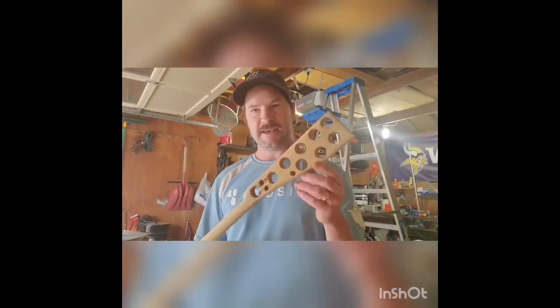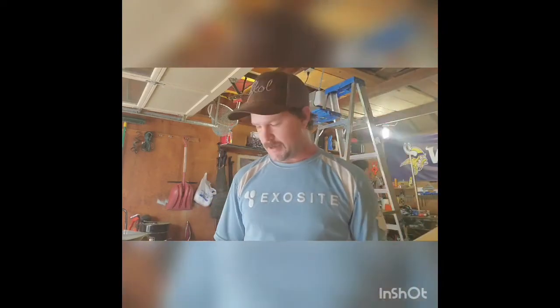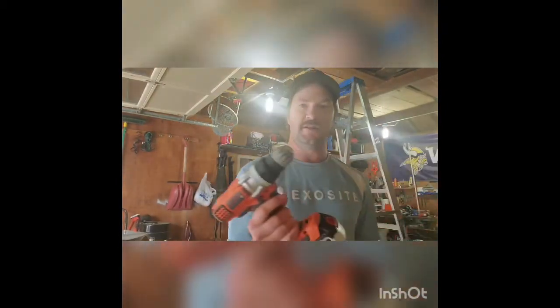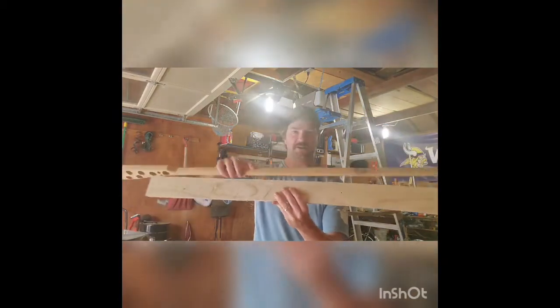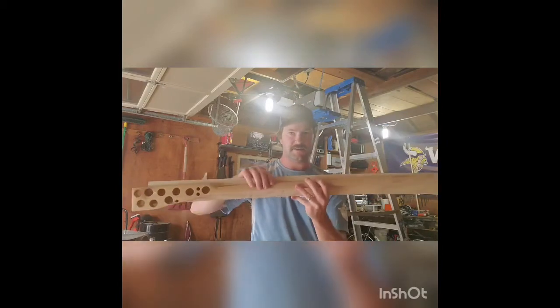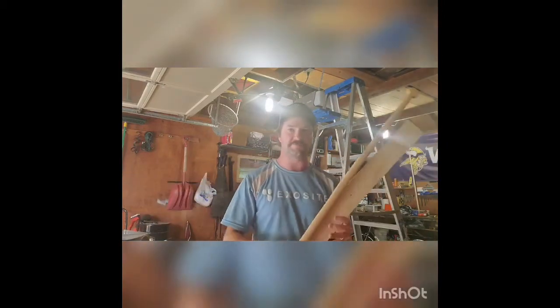A really fun day project is to make your own mash paddle. And I just had to make a new one because mine snapped the other day. All you really need is a piece of lumber that's a little bit strong, thick enough that it can hold up to some hard stirring. And then you need a jigsaw and a power drill, and simple as that. Basically, you just mark your template out on a piece of wood, something like this, and then you mark what you want your paddle to look like with a pencil, and then you just cut it out with your jigsaw.